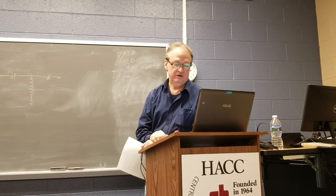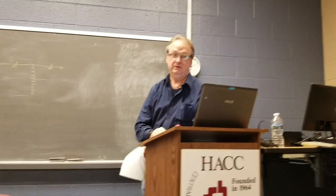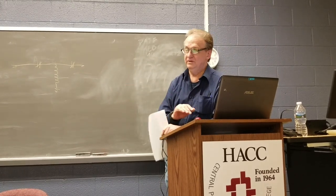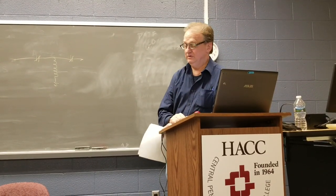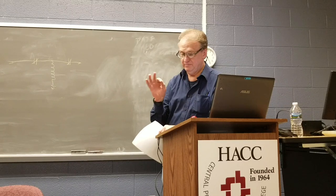Now there are some antennas, which I'll get into later, and I'll pass something around when we get to that point. There are some antennas with ladder line where everything from that antenna tuner out, including the ladder line, is part of the antenna. A lot of you know about the G5RVs, where that ladder line is part of the antenna. The G5RV was made to work on 20 meters, and it's where it works best, but with some adjustments from an ATU, transmatch, antenna tuner, you can cheat it and make it come around to different frequencies.